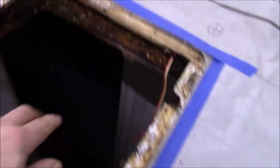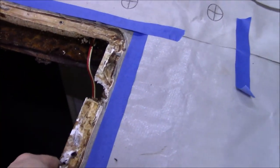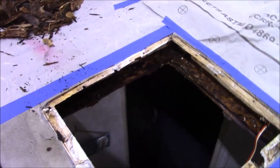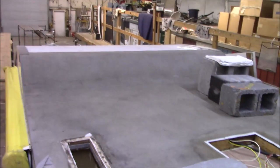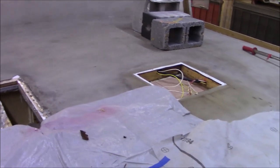So this old spray technique didn't work too well. We're going to replace the frame — the ceiling is rotted — but the aluminum is all tight so we're not going to rip it up, that would be a big mess. The best thing is to go in from the side and fix the ceiling on this application. We also sprayed everything with mold kill. Spray-on roofs don't solve the problem — that's the whole purpose of flashing and counter flashing on a roof system, that's how it functions. Once we prep both pieces we can get it all glued on and she's going to rock and roll.